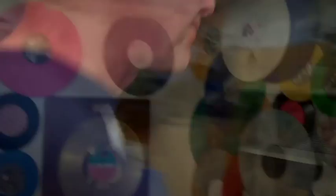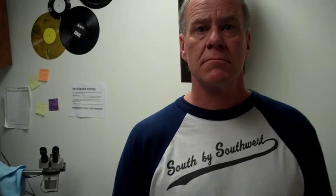We're constantly listening and looking at the records. The quality guys look at every record, and the people in packing look at every record too. Someone is dedicated to this — they'll sit and listen. Every 25th record, they'll play the lead-ins and lead-outs, and while doing that, they'll examine the rest, restack them, let the record play, and then move to the next job. It's a constant, all-day-long sort of thing.